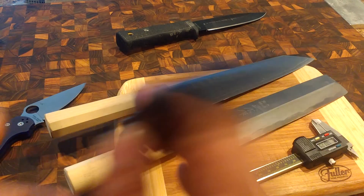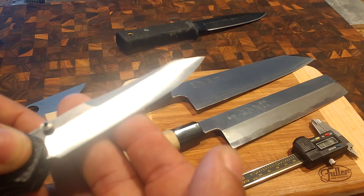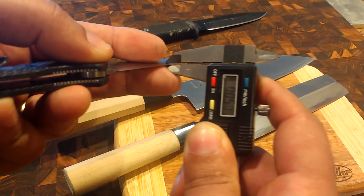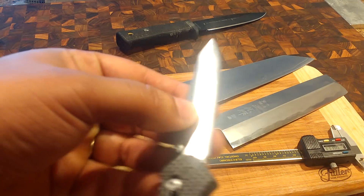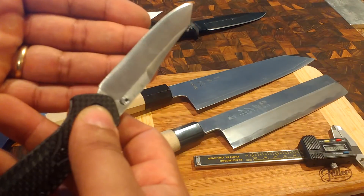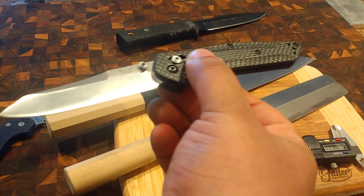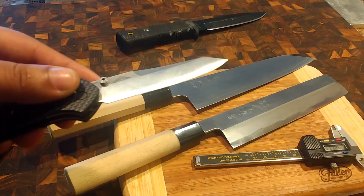So I had to go ahead and regrind this blade because my bevels were just getting so huge that I wasn't able to really enjoy this knife. I thinned that out. You can see the micro bevel right there. With my digital calipers, going right behind that micro bevel, we're about 20 thousandths behind that edge. There's slight convexity to it — it's not the sexiest regrind, but I did it myself. Now I've got a knife that cuts the way I want. It's going to be incredibly easy to sharpen. I don't have to remove that much material to make it cut. But it's never going to be as durable as it once was — not as hard use as it was out of the box. Now it's going to be more of a knife that I like. I'm more of a precision user — I like stuff that cuts really well and sharpens good.